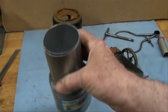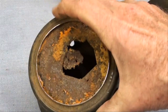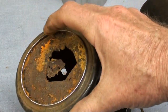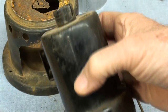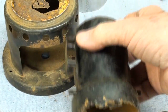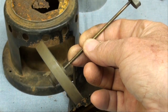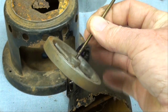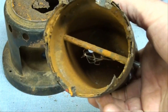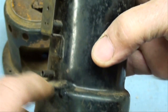I've started to sand this down on the big belt sander, but it looks like I'll have to take a little four-and-a-half-inch grinder and work away at that. I've stripped the rest of the boiler down — I've taken the whistle out, the plug, the shaft along with the wheel, which was pressed on so I was able to pull it off. I already straightened the shaft; there was just a little bend about where my pinky finger is. This bearing — what looks like a shaft — is actually a piece of tubing that goes clear through the boiler and is soldered in leak-proof.